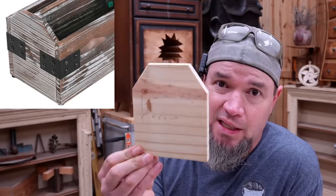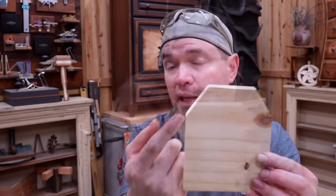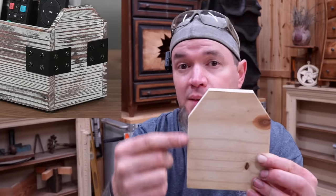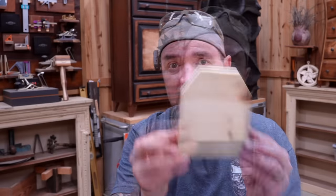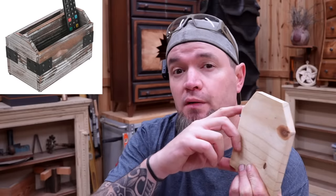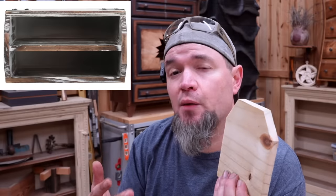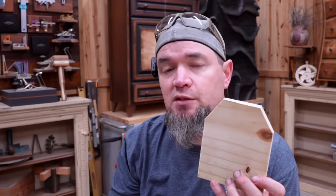The two end pieces are going to be the most complicated part of this whole build — and it's not complicated. It's five and a half inches tall and I cut it at four and a half inches wide. As far as the angles, I measured in an inch on each side and made a mark, and for the bottom part of the angle, I measured up four inches based on the picture. So I had my four-inch mark and my one-inch end, then I just cut that angle and repeated for the other side. Now I have a template — I can lay this on a picket all the way down and cut several of these. We'll need two of these end boards. For the sides, we need two boards that are four inches by six and a half inches long. The center divider is one board that is five and a half inches by six and a half inches long. I would assemble this with brad nails and wood glue, starting with the sides, then slide the center divider into the middle and throw in a couple more brad nails from each end. For the bottom, all they've used is a quarter-inch piece of plywood tacked from underneath.